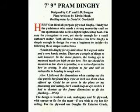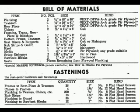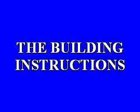First, you must assemble the materials. In addition to the wood and fastenings, you will need glue and clamps. You will also need primers, paints, undercoat, top coat, as well as anti-fouling bottom paint if the boat is to be left on a mooring. If it is not, then you can dispense with the bottom paint. Before you begin work, study these plans until the details of each step in construction are clear in your mind. The hull is constructed bottom up, on sawhorses or cross pieces. Later, it is reversed so that work can be done on the interior of the boat.